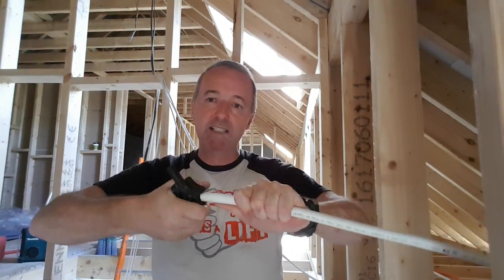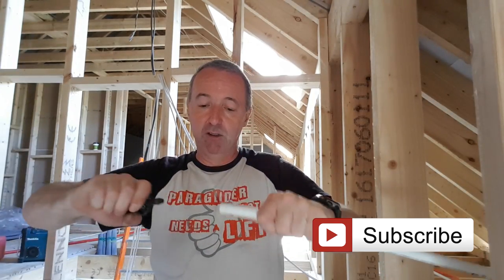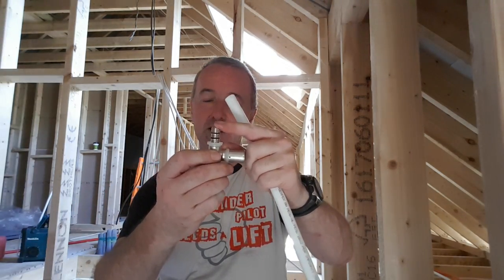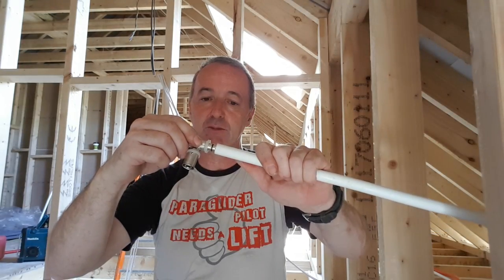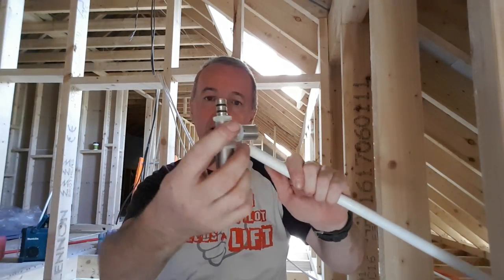The procedure for doing that is we use one of these reamers. It goes into the pipe and it dresses the end of the pipe. So we end up with a chamfer on the inside edge to aid the O-ring to slide in without getting pushed off. It also widens the pipe to that diameter. And that should push in, which it does — you can see it go in. No problem. And I should be able to take it back out as well without pulling the rings off.